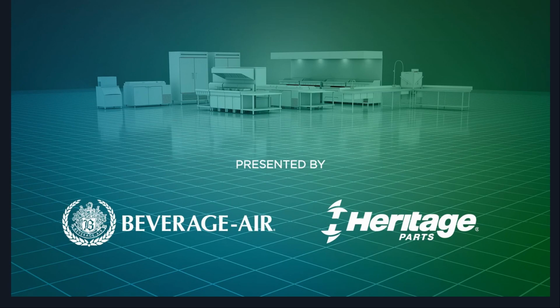Now, there is one tidbit that I don't think I touched on. Most of our systems, most of our 48-inch horizontal units, 27-inch horizontal units, have less than 3 ounces of propane in them. That's 3 ounces total. So if you were to go to your local convenience store and buy a medium-sized butane lighter, you're purchasing something with more liquid butane, propane. They're similar enough. So you would be able to purchase something that has more than 3 ounces of propane in liquid capacity than is actually in this system. So just keep that in mind.